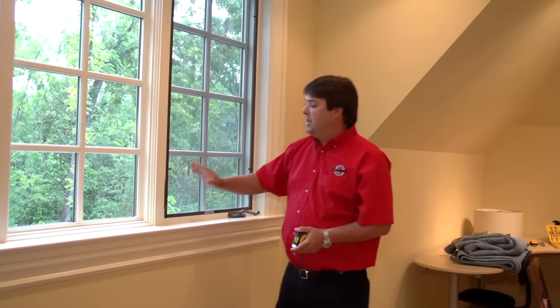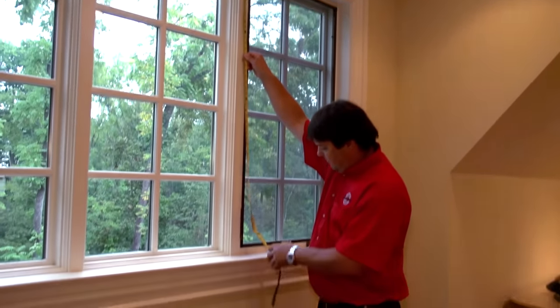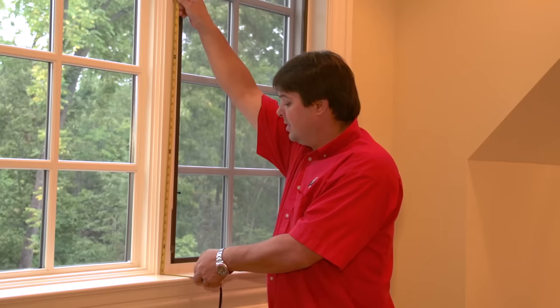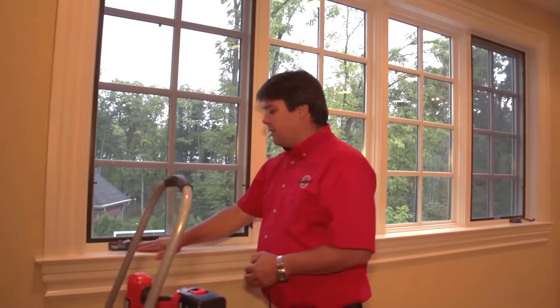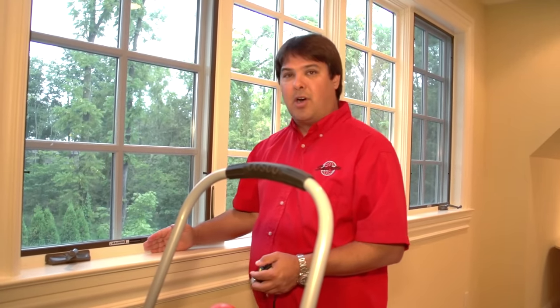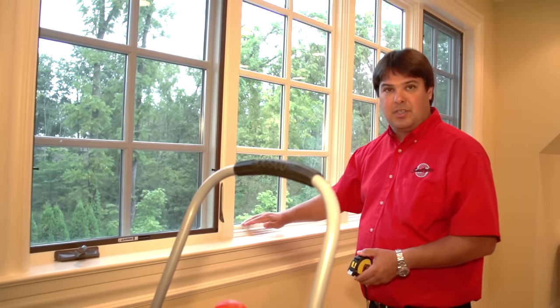We need about 2 inches of depth to fully conceal the headboard of our Roman Shades. Because we're going to go inside mount, we really only need to get the height or the length of the Roman Shade and then the finished width of each shade. I'm measuring and getting 51 and 3/8 inches. We'll confirm that measurement at the center and edges. I'm noticing some handle hardware, so I'm going to write down 51 inches for my height so the bottom weighted bar doesn't crash down on the windowsill.